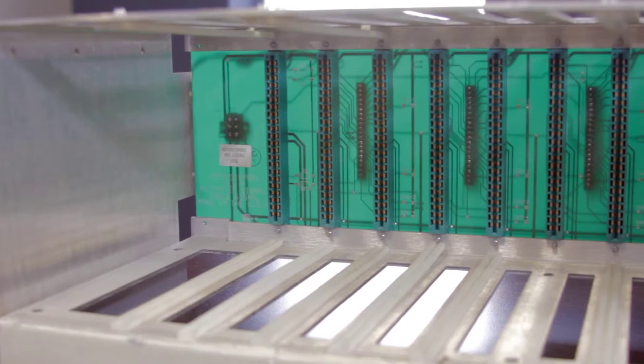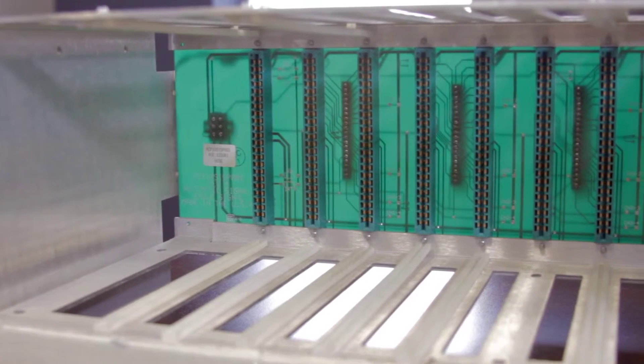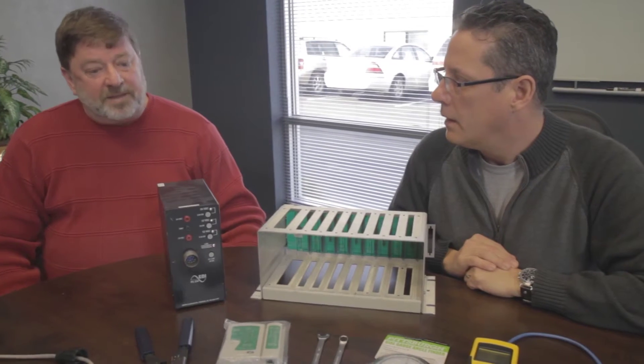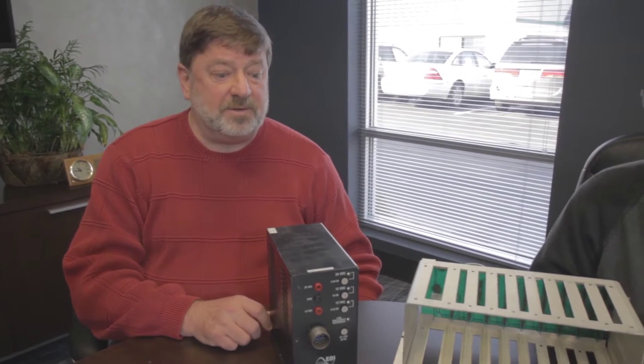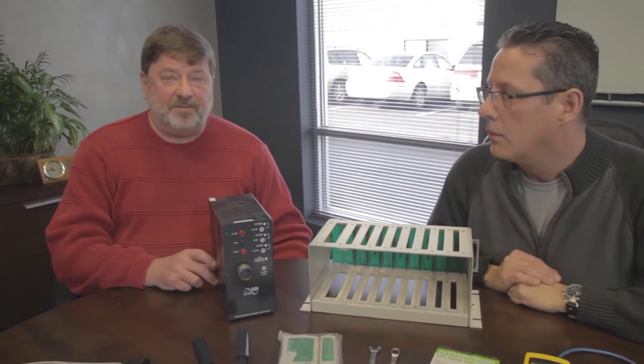You'll also need to make sure that there's a detector rack in the cabinet which you're going to put your TCID card in, and the power supply. For the power supply we recommend at least one amp per Intersector that you're going to install, so you need to make sure that the power supply has enough capacity for it.